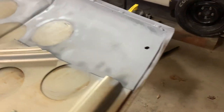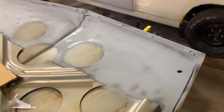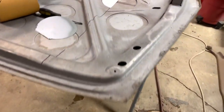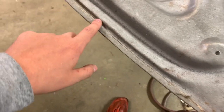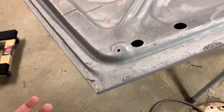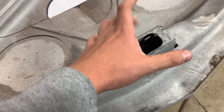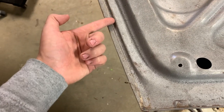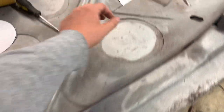It is the next morning. I sprayed some rust inhibitor last night, let it dry, and then primed it with some weldable primer. Over here we marked it 33 and a half inches, and now we are going to cut it out. We have to be really careful because we don't want to damage this piece — I don't care if we damage the skin because the hood is junk. So I think we should just cut this out carefully so we don't mess that up.